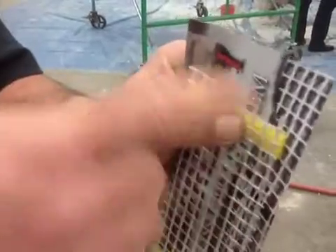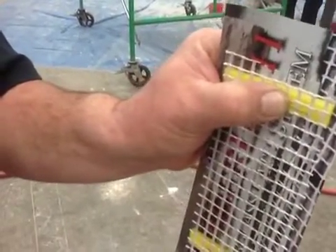We've gone another step further in that traditionally, when you put lath up, you would just fasten into the lath right through the WRB. Therefore, you're going to damage that weather-resistive barrier, which is protecting your substrate and your home. So you will compromise the home if any water intrusion gets through that weather-resistive barrier. What we've done is designed this stripping material to be compressive, so when you put your fastener through that material, it will compress and seal that intrusion you made into the weather-resistive barrier.